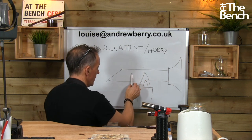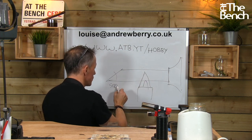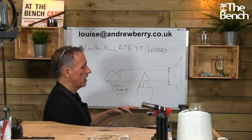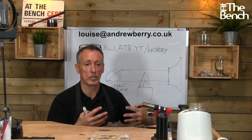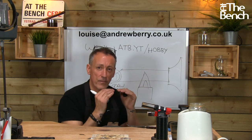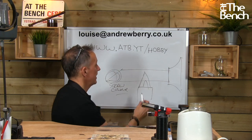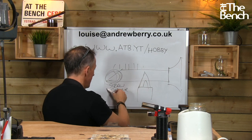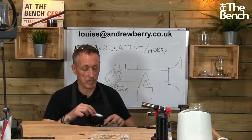You'll see the colour change as this area heats up. And when the tip here gets to a straw colour — stop heating it. Because if you use the graver straight after immersing it in the oil, it is too brittle. You just want to take that brittleness off a fraction to make it workable, so the tip will not snap. Keep heating until the colour moves down, and as soon as the tip gets to a straw colour, stop. You've tempered it. You've reduced the brittleness, and now the graver is good to go.